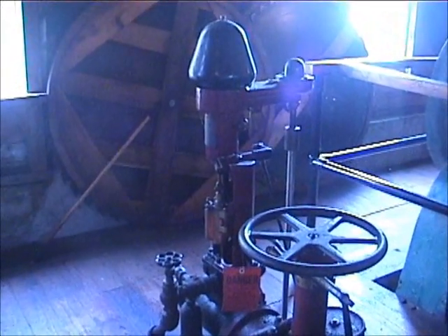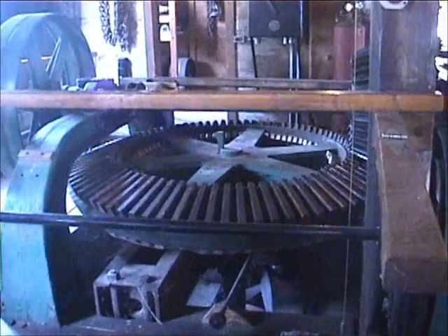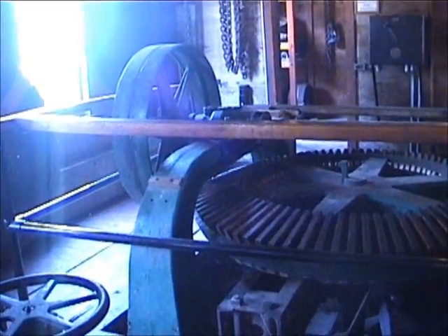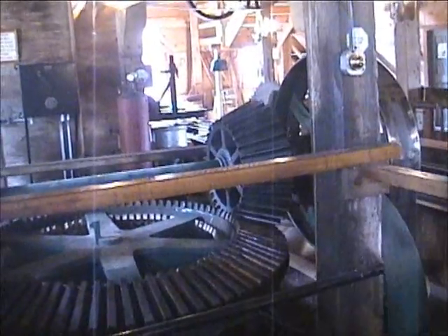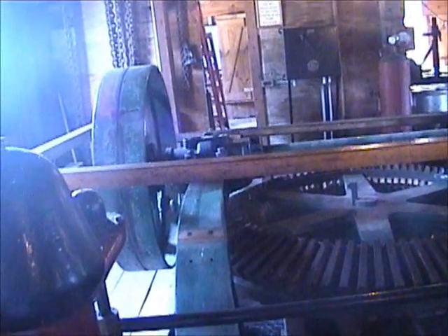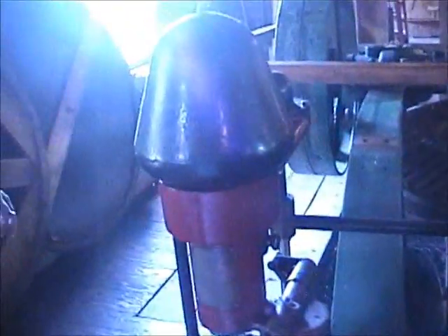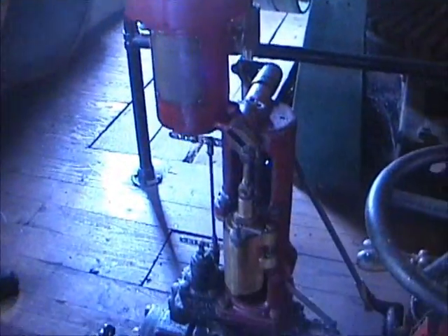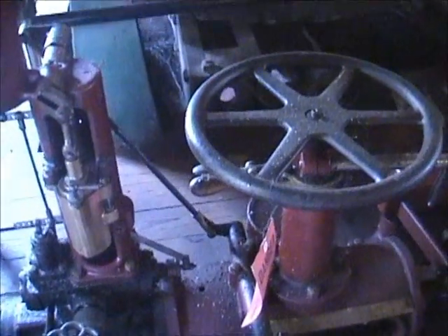If you go on Leffel's website, there's a picture of the turbine before they took it out and rebuilt it. The gears would get replaced about every 10 to 12 years. They could make a hell of a racket if they were cast, because they're going to wear out and get really sloppy. New ones wear out too, but you can put the teeth back in. We use a lot of beeswax as lubrication.